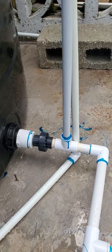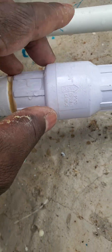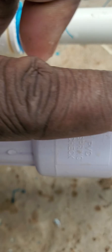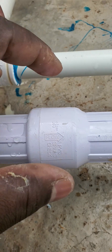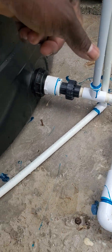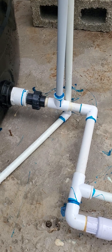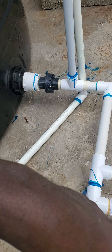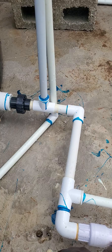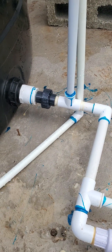So this is the T where the vent pipe is open. You might ask — how come the water is not running from the main through the vent pipe? Right here I have a socket and a non-return valve, or check valve, and it's marked with a flow arrow pointing one way, which means the water can only go that direction. Most of these have a cone shape — even if you don't see the arrow, you know which way the water flows. This allows water to come from the tank and only go in one direction — it can't go back and fall through the bottom. If you don't have a non-return valve at the bottom of the water tank, even with the high-up valve in the tank, when the high-up valve closes, water can still flow through the bottom of the tank and cause it to overflow.